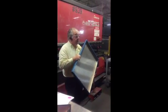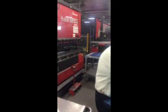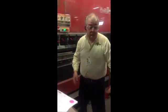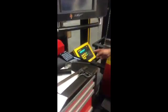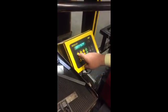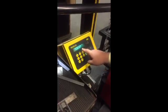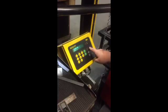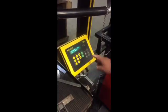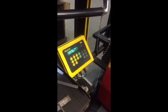This is where you want to teach an actual part. The first thing we're going to do is go over to the Merlin control box. Go into the jobs column, hit the select key, and scroll until you find a screen that says 'create a job.' Press the enter key, and it should say step one is ready. If it says anything other than step one is ready, exit out and re-enter again, and that will always bring you back to step one is ready.